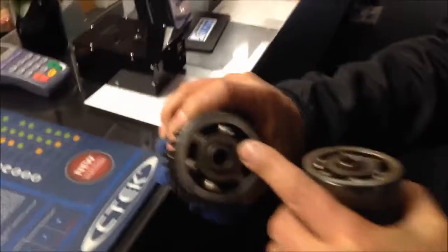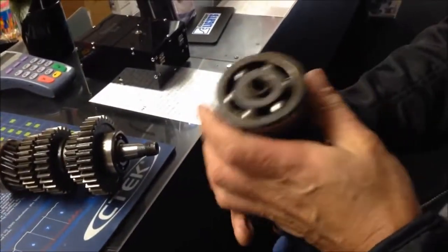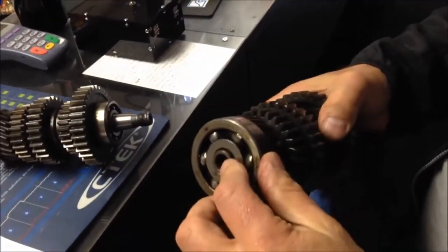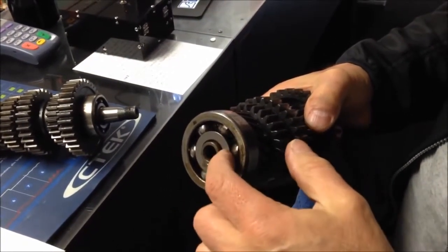And also the very last shaft, which has a circlip — that's where the circlip goes, right on the very end. In 1986, they determined, in their infinite wisdom, that on paper it appeared as though there was sufficient interference fit between the shaft and the bearings, so the clip was no longer needed.